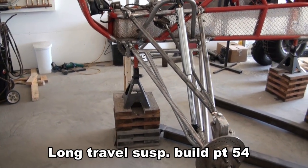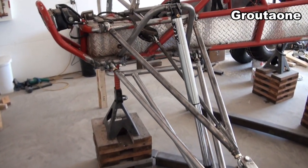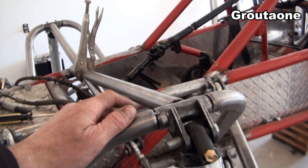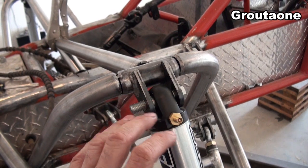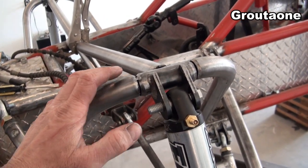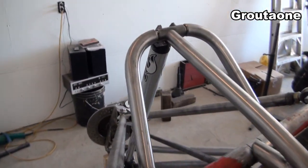Basic reassembly again with the new shock mounts. You can see that shock has got a whole different angle to it and it's actually very comparable to the angle of the shocks in the rear. Today I was working on these shock towers, and a couple of videos back I was showing you guys how I determine where this shock mount needs to be. I made this stuff up recently so it needs welding yet. This is part of an X-brace that goes across to the other side.